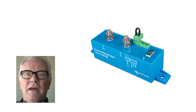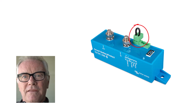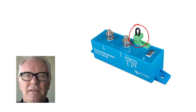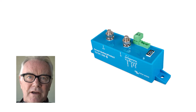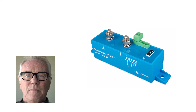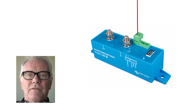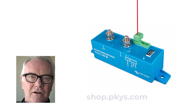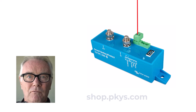To set that up, you have to make a small wiring change. There's a little green plug that has a jumper in it, and that jumper is essentially the on-off switch for the device. When you take the jumper out it will be off, so you replace that with a wire from the BMS to the H terminal. The BMS provides a positive signal when the Battery Protect is on, so the BMS can turn off the device at will by shutting off the signal to that wire.